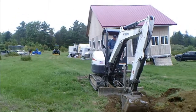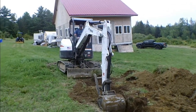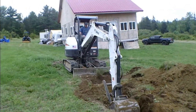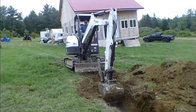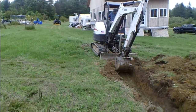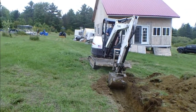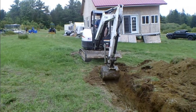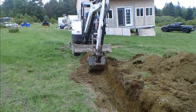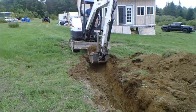The other solution for this is to give our 6-inch sand cushion on the bottom, and then the cushion on top, and then just pour some cement over it. I have a large supply of 1.5-inch blue styrofoam insulation. We can cut panels of that, lay it on top, and then use that as forms, and just pour some concrete on top, and that will be additional protection against digging that would damage the cable, which is the whole point of having 24 inches below.